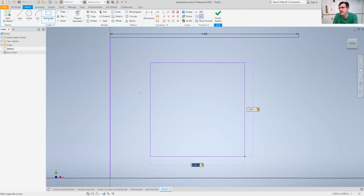Previously, we started from the top and went down. And now we're going to start from the bottom and go up because these finger joints have to line up with each other. And they specifically have to line up so that the part that goes out matches up with the part that goes in on the other ones. Otherwise, they don't work. So we're going to do 1/8 inch less 1/80 for the kerf by 1/4 inch less 1/80 inch for the kerf.